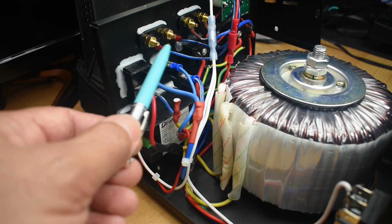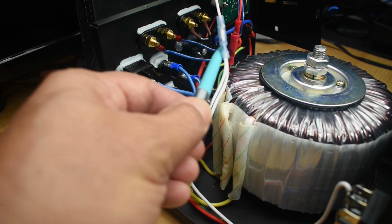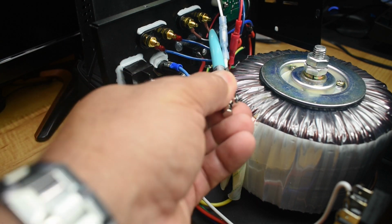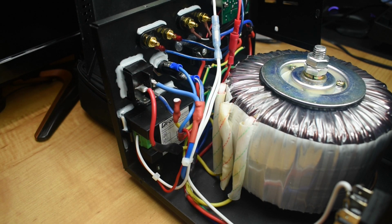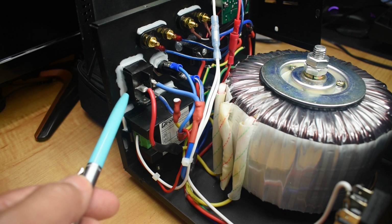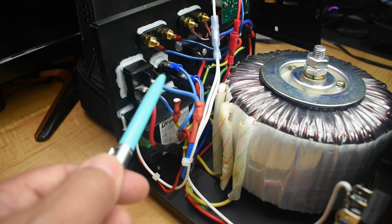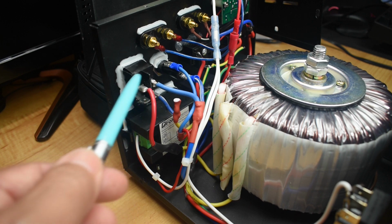Each one of the binding posts, you can see the two blue wires. There's a ring terminal, and the same thing over here. There's a brown and a brown tied onto these posts, leading to the 12 volt power supply. The only purpose for the wire on this side right here is to complete the circuit, so when the switch is in the on position, the internal lamp can come on. It'll have the full circuit from the hot to the neutral.